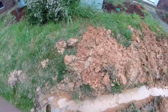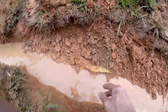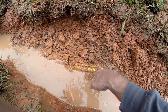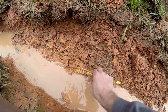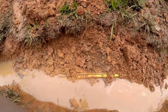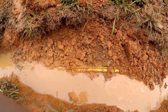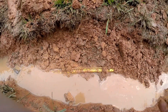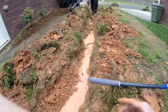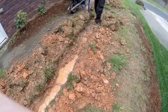We're going to send it all the way down here to the street. What I wanted to show you is how shallow this gas line is — it's only about eight inches deep, and the caution flag is nowhere near where it's supposed to be. This is exactly why you need to locate utilities. We called the utility companies and had them locate, but they did not locate the gas line, so we had to widen and move our trench over — which is a pain, but it's just another day in the dirt.